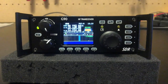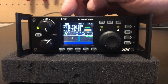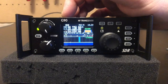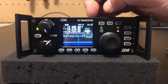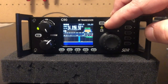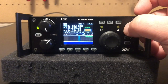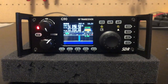You're mostly going to be playing with this VFO knob and the function button to deep dive into settings. On the top I can change the mode button — you can see we cycle through USB, LSB, AM, CWR, CW, and back to USB. The right two buttons cycle between the bands. This next button is basically your memory, so if you have any memory stored you can cycle through there. This button here switches between VFO A and B.